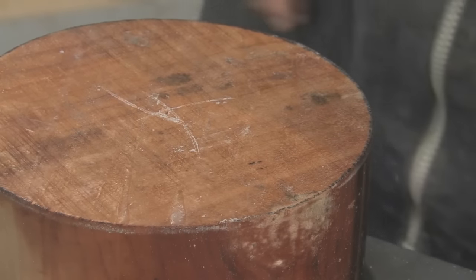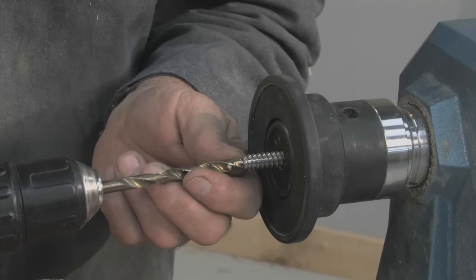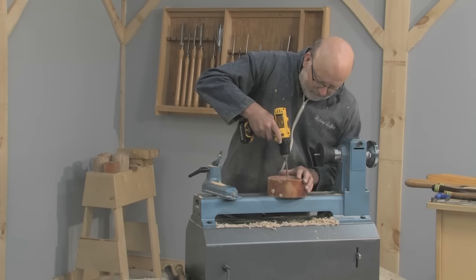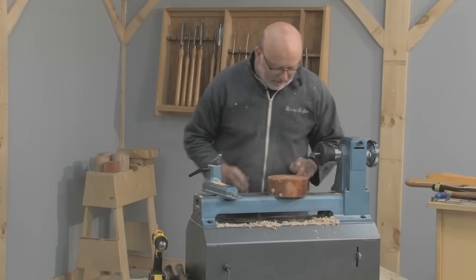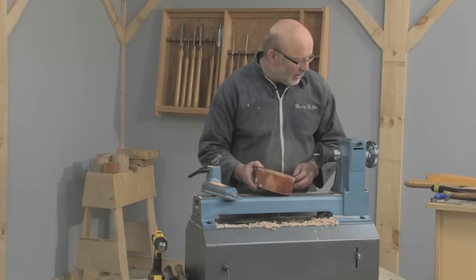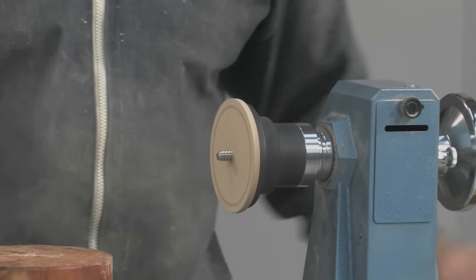You need to drill a hole in the middle. The drill is the same diameter as the shank on the screw chuck, and I drill the holes more or less upright — it doesn't matter if it's a couple of degrees off. I don't need all that screw, so I use some little plywood discs just to reduce the effective length, and that should be all right.